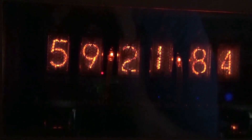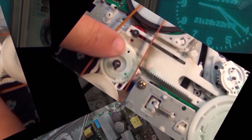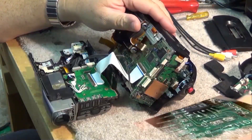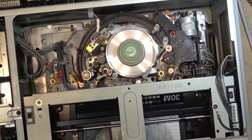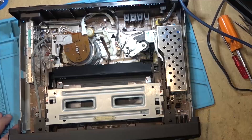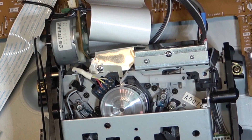In this video we have a small CRT set that's totally dead. It doesn't matter what brand — they all work the same way. This is pretty basic troubleshooting of the horizontal drive and horizontal output section to determine where the fault is. It's an open resistor — we're going to check it out with both the meter and the scope.